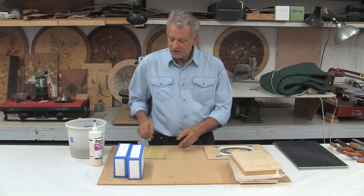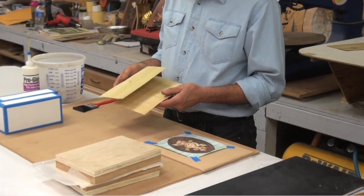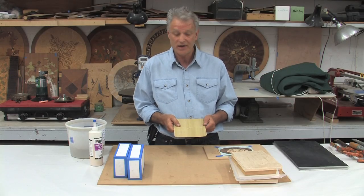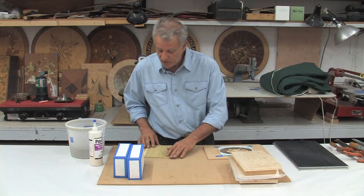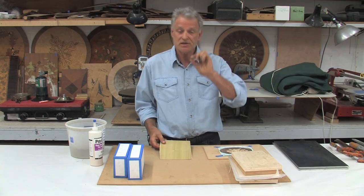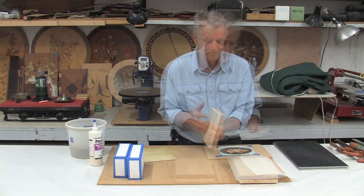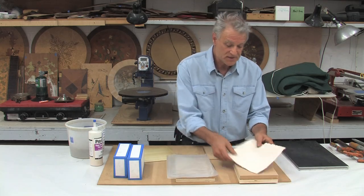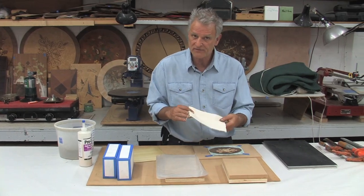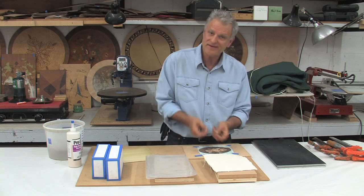In preparation for glue up, there's a few things that we need to gather. In your optional kit you had another two pieces of poplar or other veneer that we're going to be using for a backer. This oval is going to need to be glued to something and I'm going to glue it to two other layers of veneer to make essentially a piece of plywood. I also have a clamping caul, which is MDF on one side, plywood on the other. Some Visqueen polyethylene plastic or the bag that your project came in. Some canvas — this is bushing canvas, like you saw in Veneering 101. It allows me to press up different thicknesses of veneer.